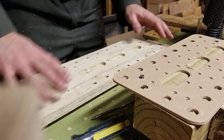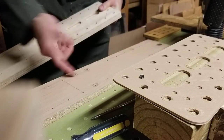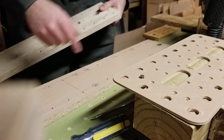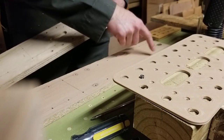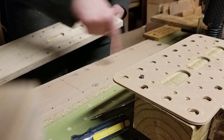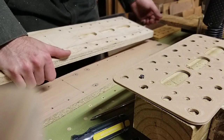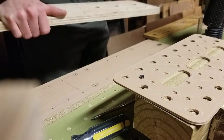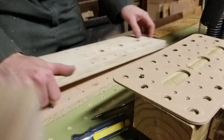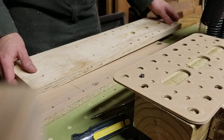And the way I do that is I just move the workpiece over, because I actually have four, but I think I can get away with two T-nuts. So there's only actually two places. There's actually four. But even if there were only two, it would be fine, because I can just move the workpiece. And this board is, of course, bolted to the table so that it doesn't move around.